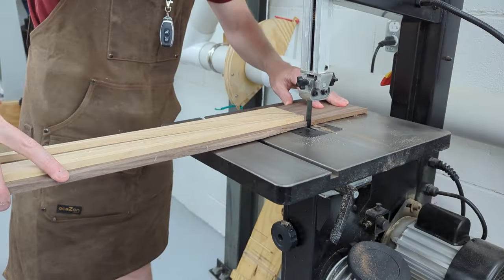This time, instead of using the spring clamps, I opt for a little more clamping power by using some bar clamps. I use my work surface to clamp the saya to in order to ensure that it stays flat during the glue up. I don't want any sort of bend to the saya, as that would make getting the katana in and out of it very difficult. I tried to use as little glue as possible in order to minimize the squeeze out on the inside, but just to be sure, I cleaned it up with a wet rag the best I could.